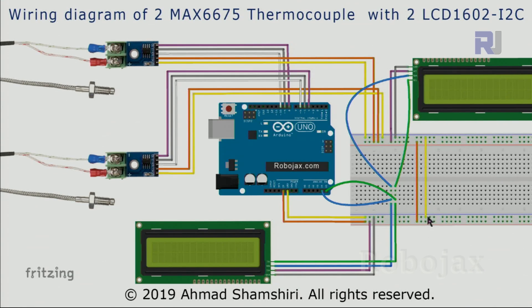From the ground, another wire goes to the other side of the breadboard, so both sides have 5 volts and ground. By convention, 5 volts is towards the red on both sides and the blue is ground. The LCD module is connected using an orange wire to 5 volts and a yellow wire to ground. These two LCD modules use I2C communication — SDA is connected using a blue wire from pin A4, and SCL (clock) is connected to A5.